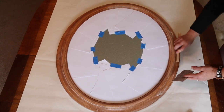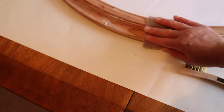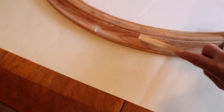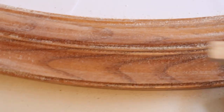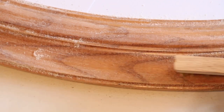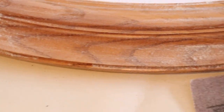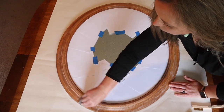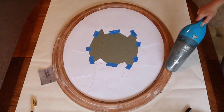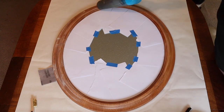You see me using the wire brush. The reason why I'm using this wire brush is because I want to create a tooth on this mirror. In the furniture that we saw, the furniture was very textured, and that's what I'm trying to get on this mirror. So I'm using that wire brush to give some little micro teeth or micro grooves into this mirror. So later on, when we put the glaze over it, you'll be able to see these little tiny marks and it'll give it a little bit more texture. I'm just getting rid of the dust by using a little vacuum that I have on hand.